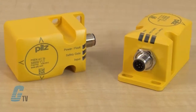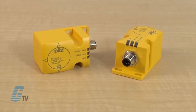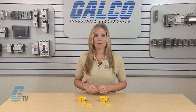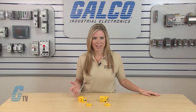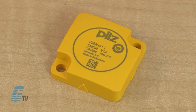These compact safety switches are housed in silicone-free PBT plastic. They offer integrated evaluations and a built-in manipulation protection which transmits a unique code from the actuator to the switch. The switch and actuator work together so that the enabled condition from the safety device is only triggered if the actuating element is within the switch's response range and the code number on the actuator matches that of the switch.